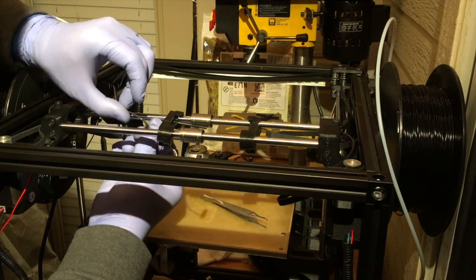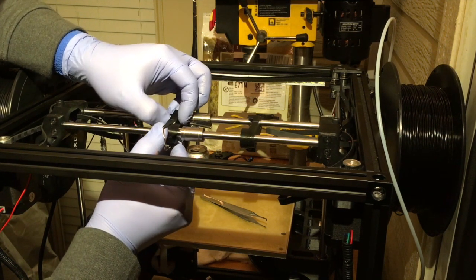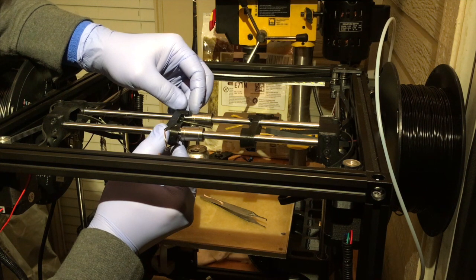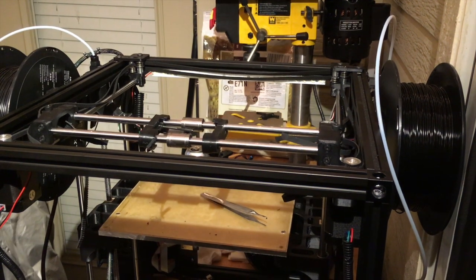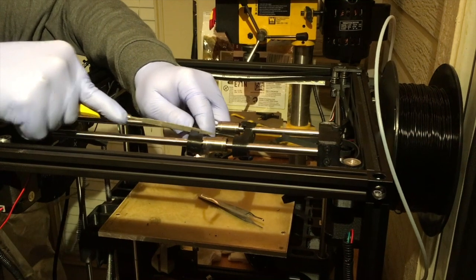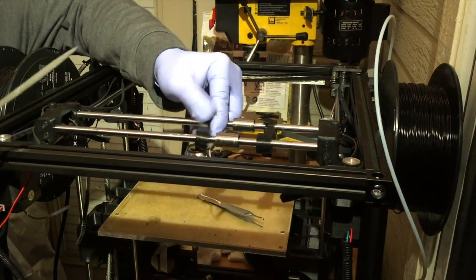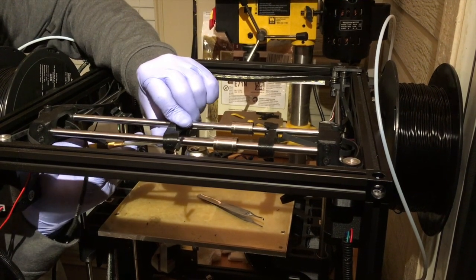All right. Sort of mark the belts where the tension is proper. But I think my first layer wasn't up to snuff, so I need to clean these out a bit for the belts to slide into them properly. One moment. Enter the file. Again, much easier to do off the printer. Tune the extrusion width, folks. Makes it easier.